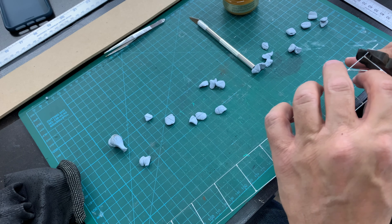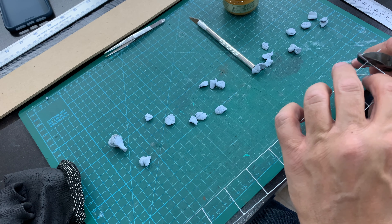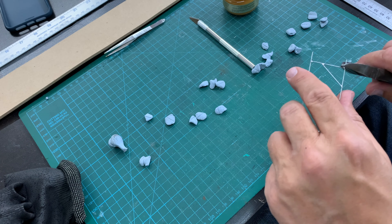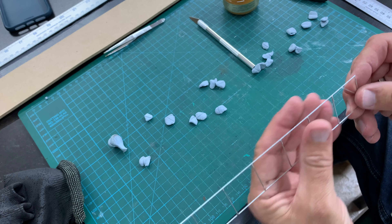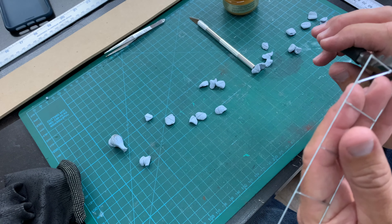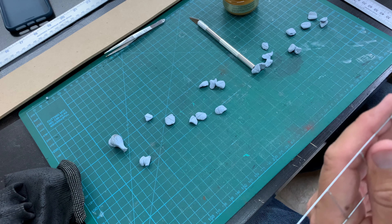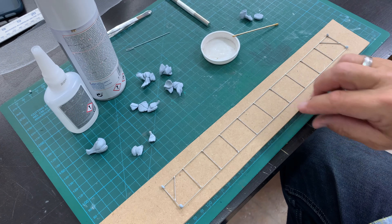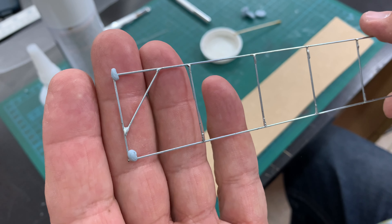Before the netting is attached, I cut off the extended sections of parallel bar, cutting as close as I can to the upright. If you do disturb a joint and it cracks, it's just a case of heating up and applying a little more solder. I find the Dremel a little too erratic for the last piece of burr here, so I'd use a little needle file. The next important thing is to attach four small balls of blue tack at the corners.